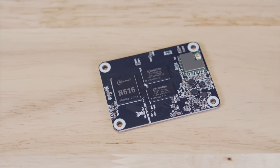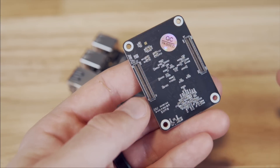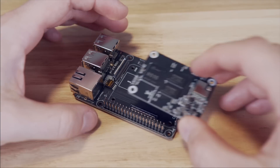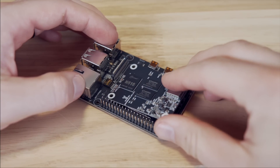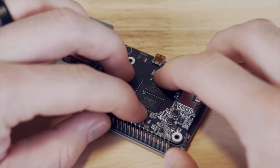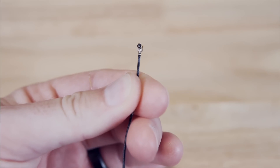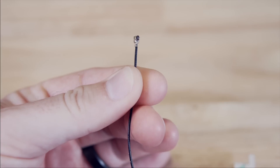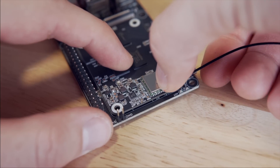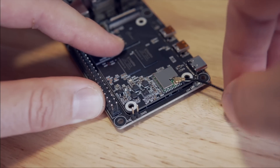Starting with the physical installation — the CB1 pins are not centered, so you can easily see the shorter side and the longer side to help you align it with the socket on the board. I recommend placing the CB1 softly onto the socket and looking to make sure everything is aligned before you apply pressure pushing it into place. It does require a little bit of force to seat properly and you should be able to feel each side clicking into place. The CB1 also has a very small Wi-Fi antenna, and if you're planning on using wireless, that is something you should install right away. It was a little tricky to get the antenna lined up and popped on, but once in place it has a very secure connection.